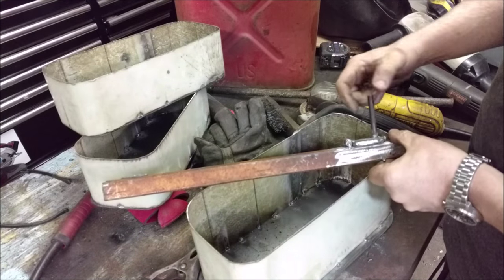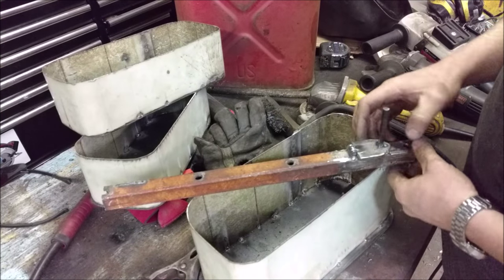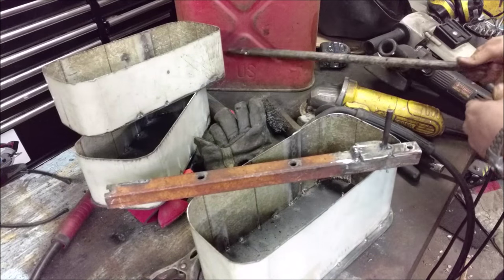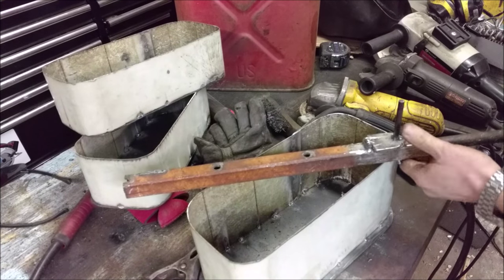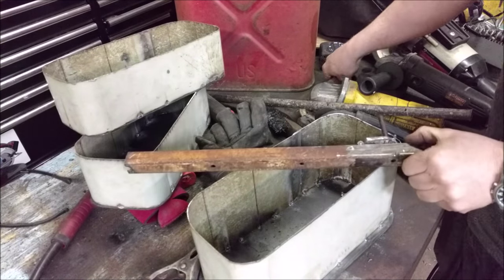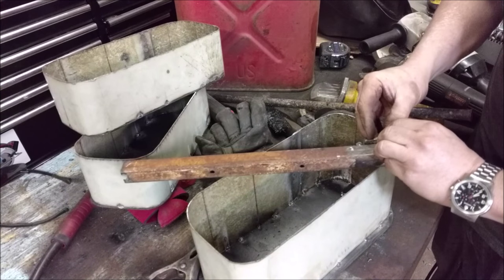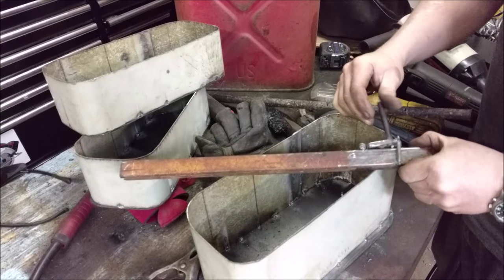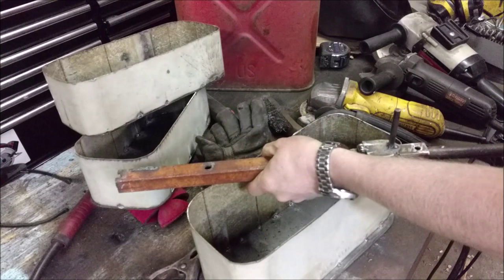I just had to move that link a little bit lower — it was too far out, so the hinge point was making it too easy to swing. But now we've got this: a hole in here so that'll go in and line up with that hole and hold it. I've got two little tabs here that actually allow me to affix a spring and keep spring tension on this.